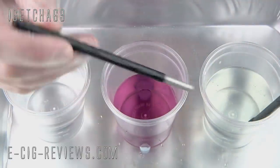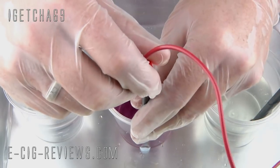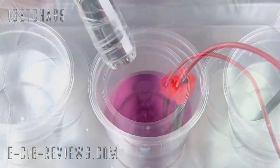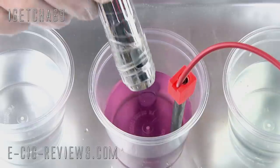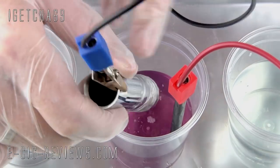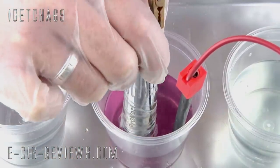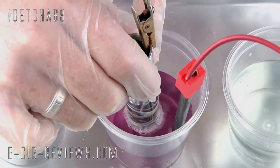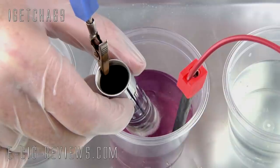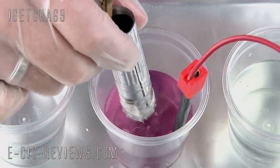Now I need to add an electrode to the gold solution — place an electrode into the solution and then swap over the positive cable. Once again, going in at an angle to prevent airlocks, just start plating your Pro Vari. My hands are pretty shaky here because I haven't got a lot of room to work in — the camera is about 12 inches above my hand and I'm trying to keep one eye on the monitor, plate the right area, and avoid touching the electrode.